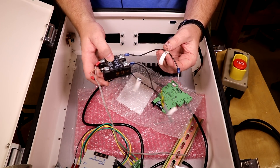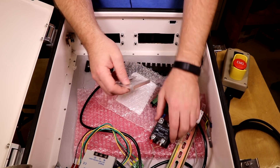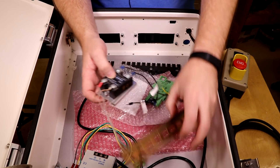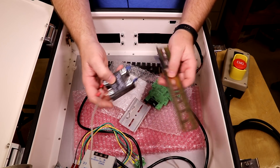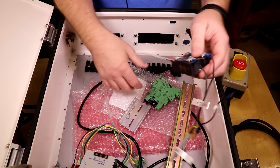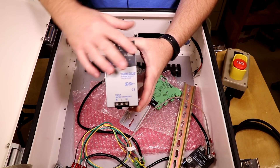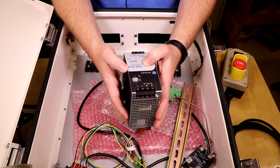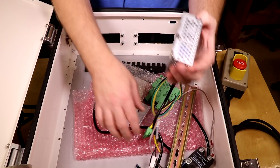I've also got a solid state relay in here — this one is going to control the brake on the Z-axis of the KR33 version one. I have a video on that. There's a mounting bracket that lets you mount the solid state relay with screws and nuts and attach it to a DIN rail. I'd prefer it mounted upright rather than sideways, and I did find some alternatives on Alibaba but the lead time was 30 days, so I didn't pull the trigger on that.